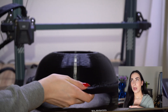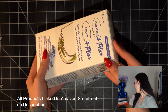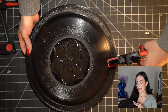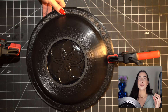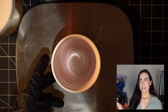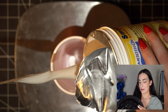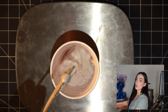I was kind of diving deep into the realm of making chocolates and stuff like that, but I wanted to take it up a notch. So I designed this model in Fusion 360 and I printed it out on my Elegoo Neptune Max. It turned out really nice — I think this was a two to three day print. I used lightning infill which didn't require a lot of material. Since this is FDM filament printed, it did have a lot of layer lines, so I added an epoxy resin top coat.